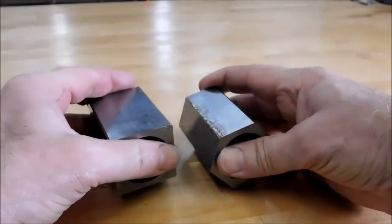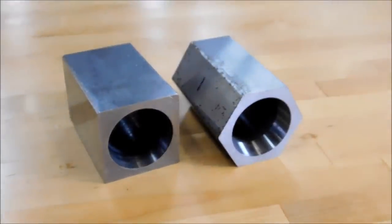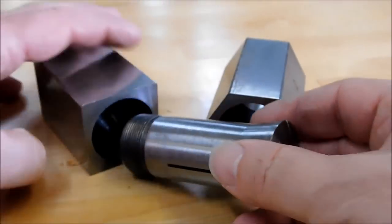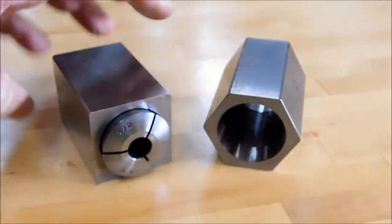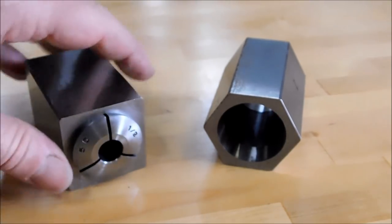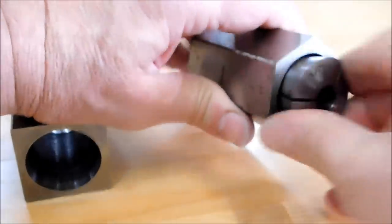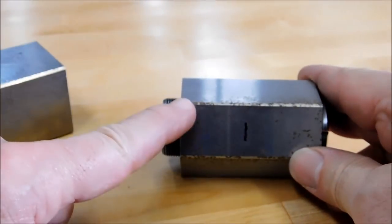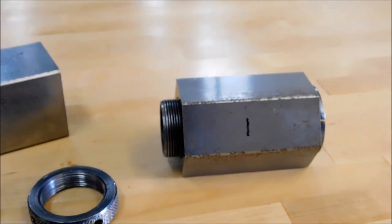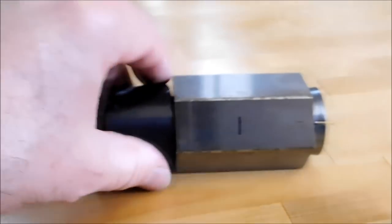Collet blocks. These particular blocks are designed to be used with 5C collets, and a 5C collet is what fits in my engine lathe here, so that works out very well. These are keyed, so as you feed them in they will key, and as you squeeze them in your vise, this will give you four position options if you want to do a square. This one will give you six. The collet does protrude out the back of the block and is normally retained with a spanner nut and a spanner wrench. There is also a quick-disconnect cam-type option that you tighten down and activate the cam to close the collet in the front.